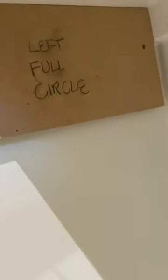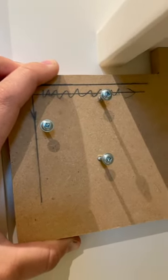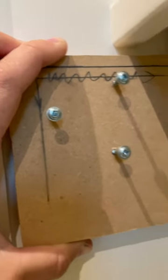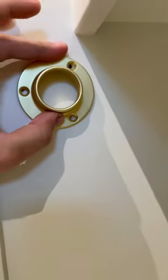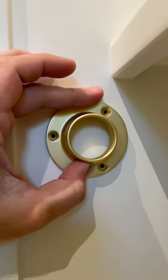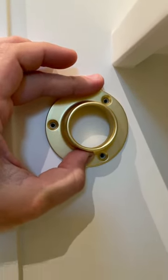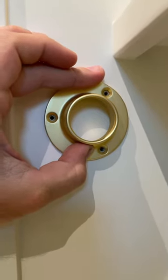This piece right here will sit back up against the cleat, underneath the shelving. Then you have your screw pattern right here — you'll take your hammer and hit each point to dimple the wood. Take the jig out, put it up right where your dimples are, then take your self-centering bit and finish piloting that screw.